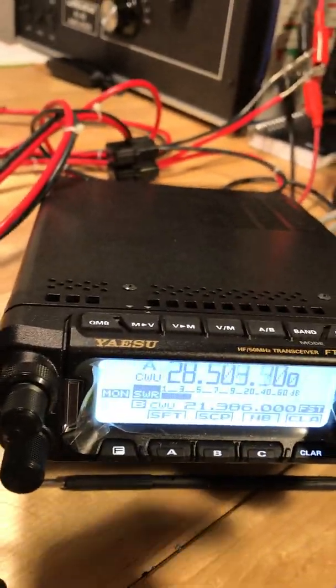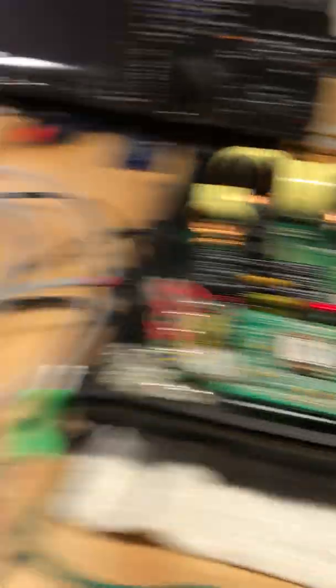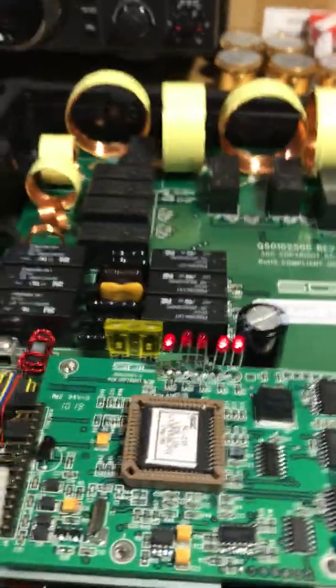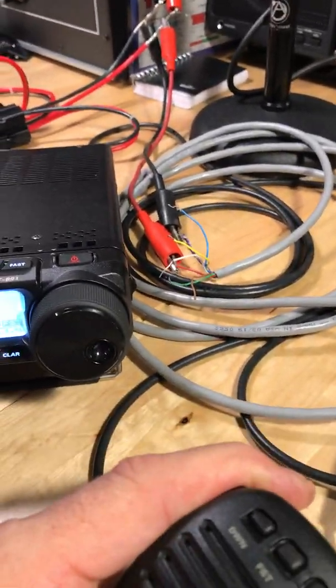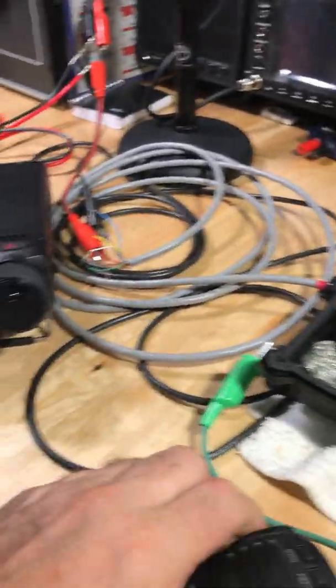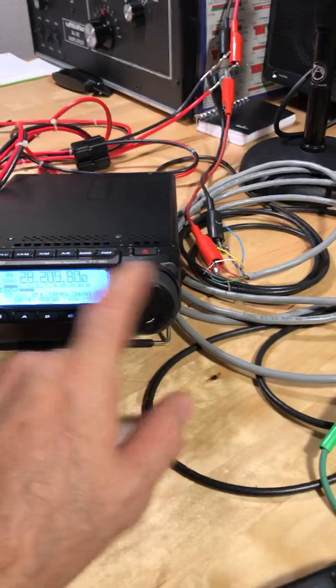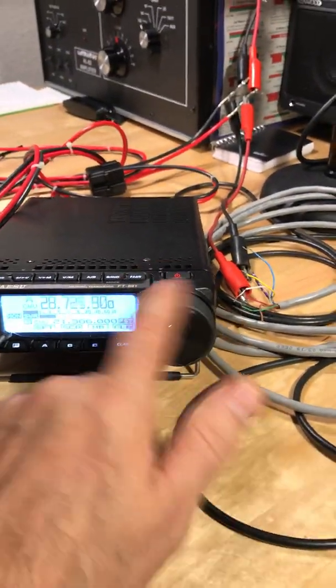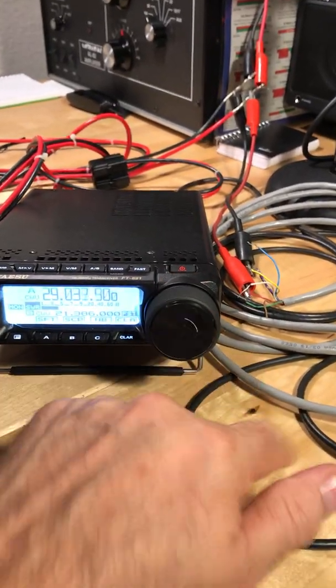It should reinitiate a full retune if it keeps looping like that — querying memory and the memory tune is giving it a higher SWR. The issue is probably because last time it tuned was not on the light bulb load — it was something else — and it's right on the threshold. 10 meters is a wide band, so that was up at 29 MHz. Let me go down to around 28.4-28.5 MHz. Now it just happens to be less than 2-to-1, just a little bit over. Not enough to trigger the LED.